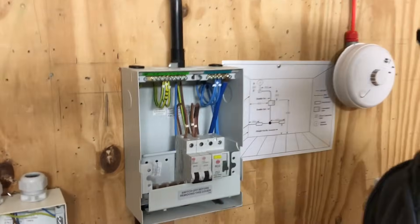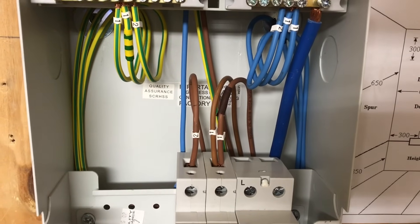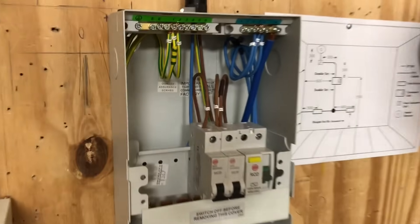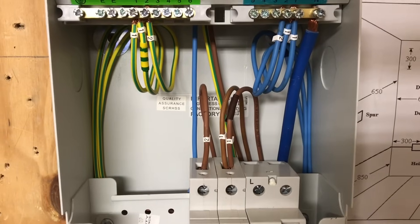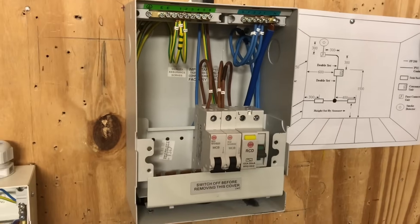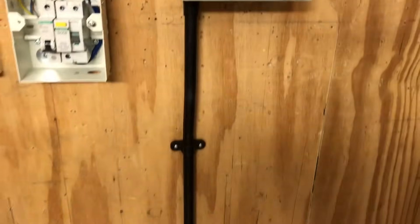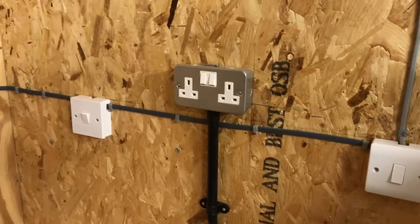So I'm in here now with Jack. I can see you're consuming your work, Jack — it looks quite neat considering how many times we've got to test this circuit. You've identified them with numbers. What were you doing that for? To show that they're different circuits, making it easier for testing and fault finding. Brilliant. On one of the circuits there, the first circuit is a 32-amp type B — what type of circuit are we mimicking for circuit number one? An A1 ring final circuit. Good. I can see you've put tape on both the circuit protective conductor, the line, and the neutral. Why have we taped those conductors? To show that they're a different leg of the circuit — a different leg of the ring final circuit, which helped during testing. So we've got a plastic conduit job for sockets, and we've got an additional socket at the top which is what in relationship to the ring? A spurred socket outlet. What size plastic conduit did we use? 20 mil. Can you give me two other common sizes? 16 and 32.